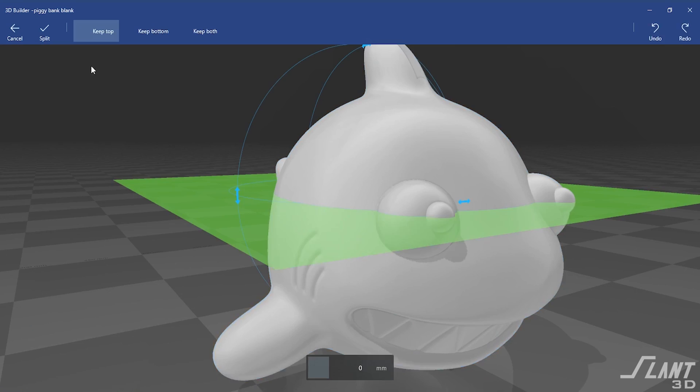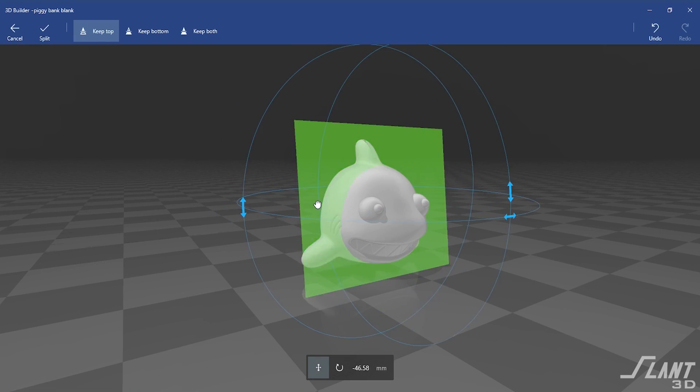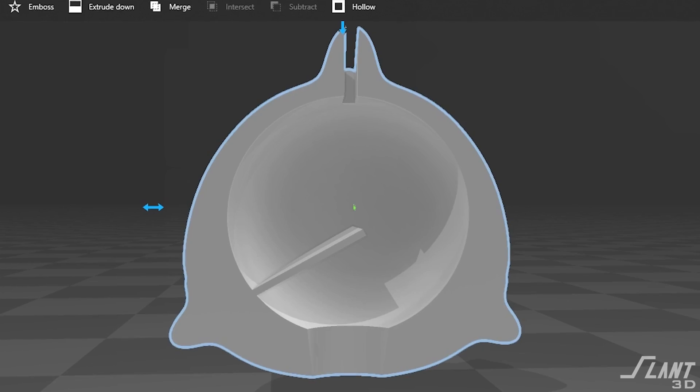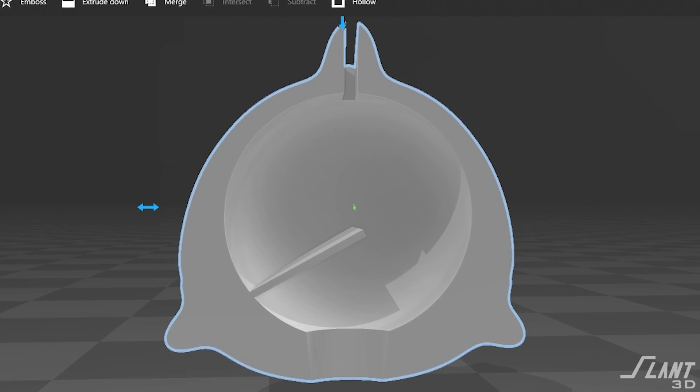But here's the real twist. It's not that hard to make a plastic part with a big old cavity inside of it. However, what we did to make this way more interesting is that there is a small ledge inside of each one of these piggy banks going diagonally across, which prevents any coins from falling straight on through. It's just a ledge — a simple ledge. So it catches the coin, giving you the fantastically satisfying thunk of the coin going in, even if the bank is empty. But then if you want to get your coins back out, you just tilt the piggy bank and they fall out of the slot on the side.